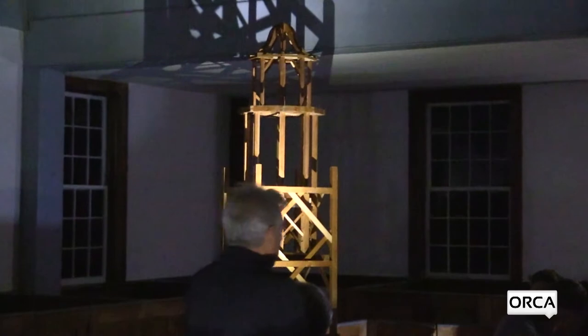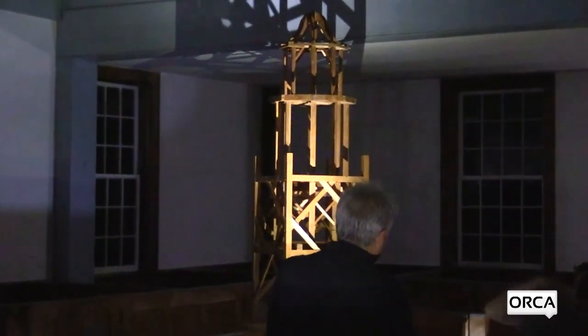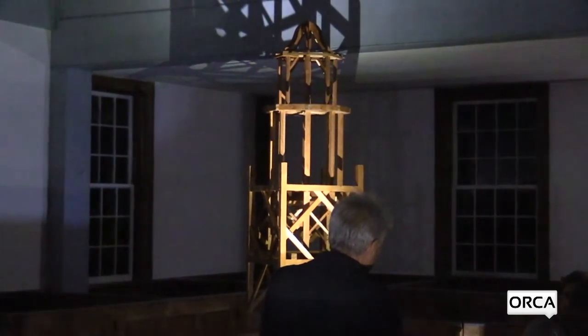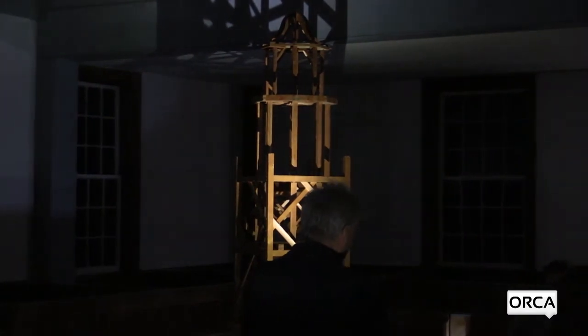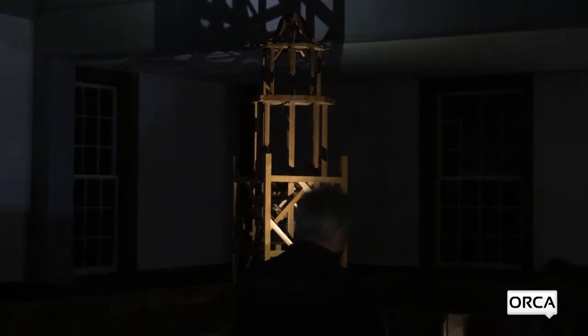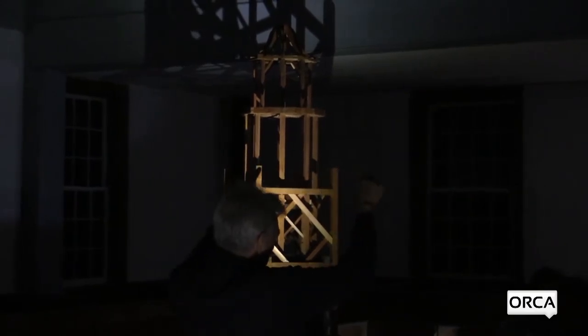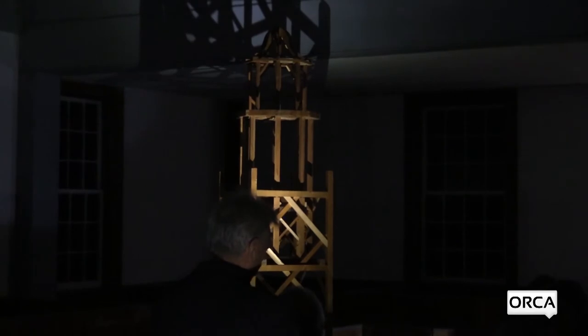What was that last sentence? So the prep work for preparing to lift the upper octagon. Right. Is that being done from staging, or is that being... No, we'll probably actually put safety harnesses on and walk on the little roofs. And also, see, you have those false lights up there, the false windows. We have to take some of those panels out to get rigging through.